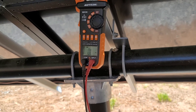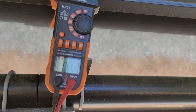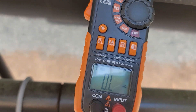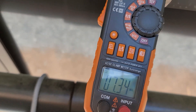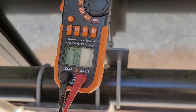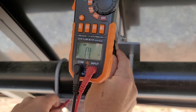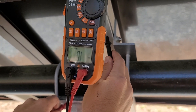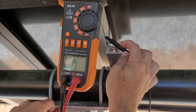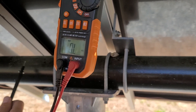The reason I decided to do this is because there's no contact between the cap and the railing. My daughter is helping me record — it's hard to see because of the sun and glare. As you can see, I'm touching the cap, and the cap is connected to the 3-inch pipe that goes down into the screw. However, there is no contact from the railing side, so we've got to provide a ground. I suspect this happens because I put truck bed coating on the 3-inch pipe and it's insulating really well.